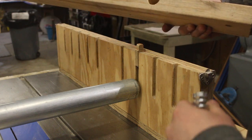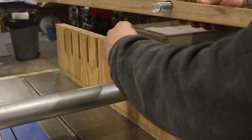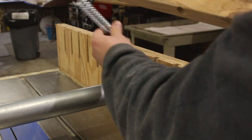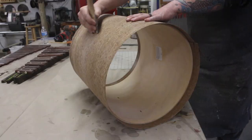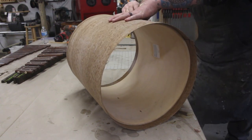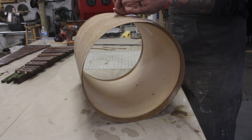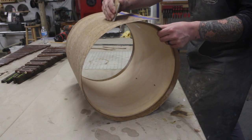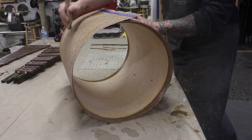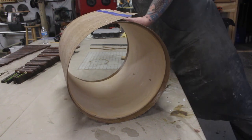This is how Bill Senior spring-loaded it — this little top rail thing has a hole for the spring, and then he made a little hardwood key so the roller goes in, this comes down on top of the roller shaft, gets sandwiched in, and clamped with hinges on both sides. Do you prefer that over a J-roller? That's actually what the veneer supplier recommends — with contact adhesives a J-roller doesn't give quite enough pressure, but this scraper comes to a point so you're putting a whole lot of pressure in small areas, making it more effective. It doesn't leave scratches or marring, and there's so much other surface prep happening anyway.